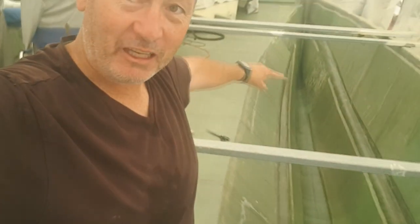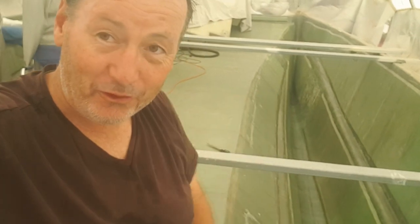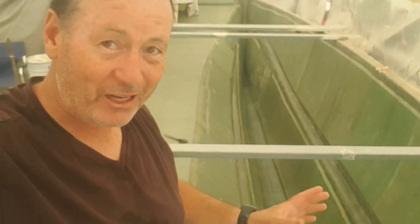I've waited six weeks to get a 20-degree day and 60% humidity, so I've just laminated this entire hull down here with two layers — 300 and 600 double bias on the foam. She's down to one layer of 300 left on this entire hull needing to be done. It's been a big day and I'm a bit sweaty and hot, but the result speaks for itself — almost perfect laminating. I'm very, very happy. It's hand laminating at its finest when you can knock off a six-hour day straight and get a result like that: clean, no voids, nice and resin-saturated but not too heavy.